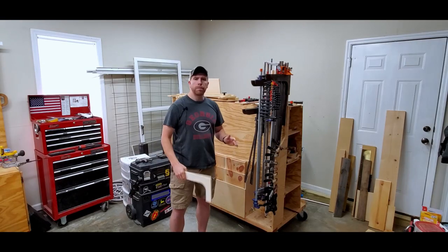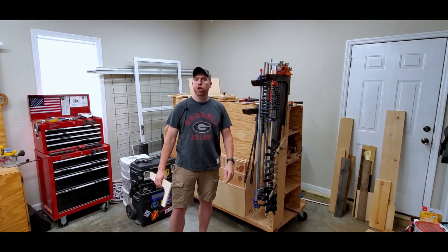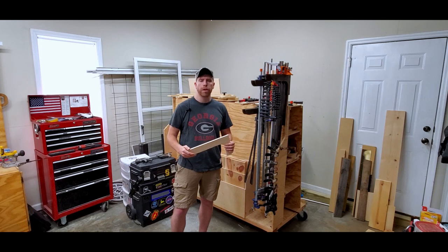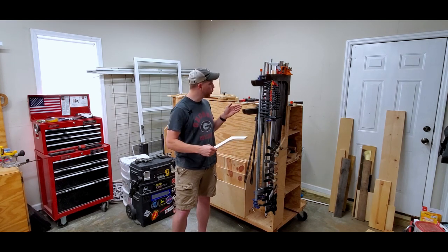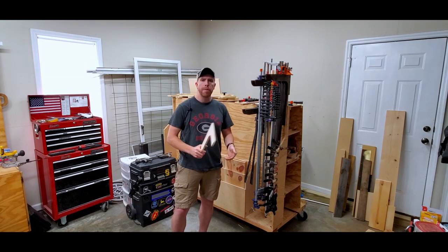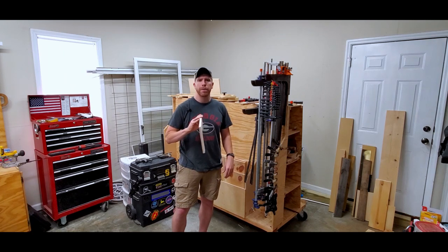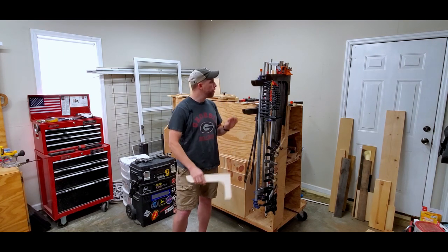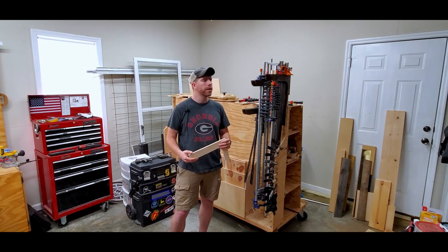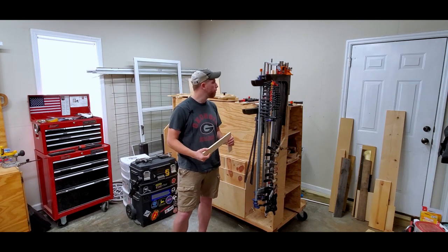Clamps are heavy, and if you're supporting a large number of them, this has to be built out of quality materials. These are glued together and I have screws to reinforce the joint and also to clamp the joint while it was drying. I made mine out of half-inch Baltic birch — this half-inch Baltic birch has 10 laminations in it. You may want to consider using three-quarter inch plywood if you don't have quality plywood on hand, just to give you that much more stiffness.